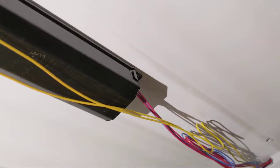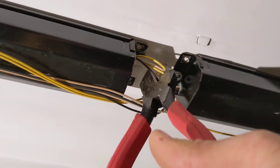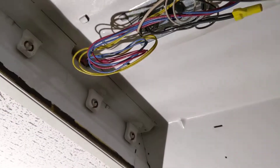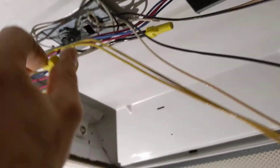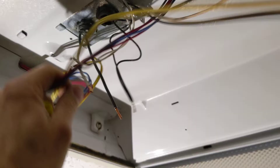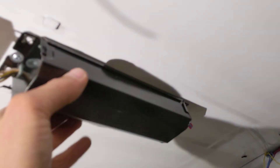I'm not going to show you a full install — this is more or less to get you going on it. But you cut the wires off right at the ballast themselves. Obviously make sure your power is off. This is the last fixture in the series of my lights. I've just now completely and totally cut out the ballast.